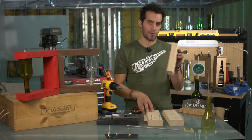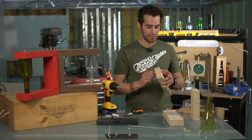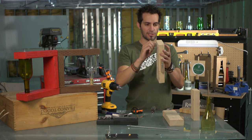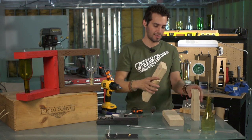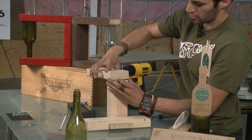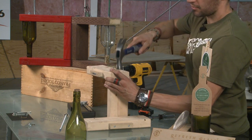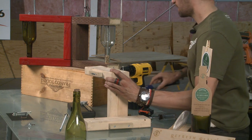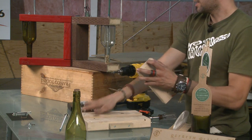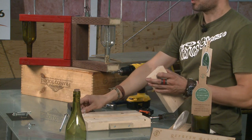Now we're going to mark our vertical piece. The way I recommend doing that is to work the screws through one of the horizontal pieces so they're sticking out maybe about a quarter inch or an eighth, then center them on your vertical piece so that everything's flush the way you like it. Take your hammer and carefully tap down a few times — this performs a function similar to the center punch, making indentations in the wood. Then take your drill and pop the holes in to leave room so the screws move in smoothly.